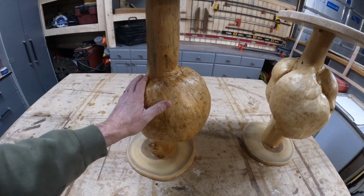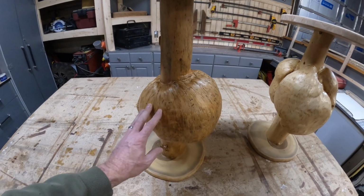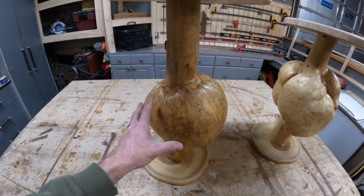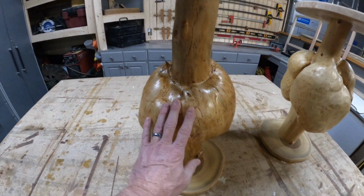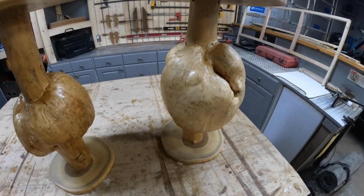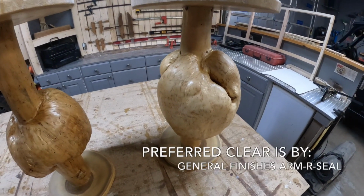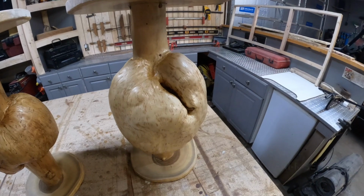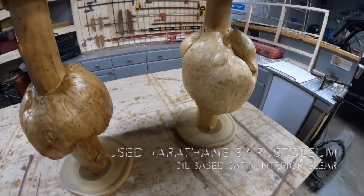And basically the step is after you get all of the bark off of it, you're going to go ahead and sand it a little bit, put some clear coat on it. I like to give it another sanding afterward once we're finished up. And we have two different clear coats. One is our preferred one. We just didn't order it yet. And there's a backup kind that we have. They're all oil based. I'll put links in the description of what we'd like to use for clear coats.